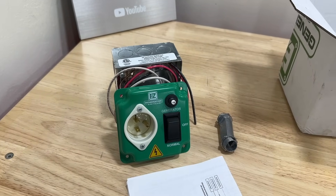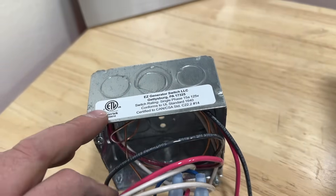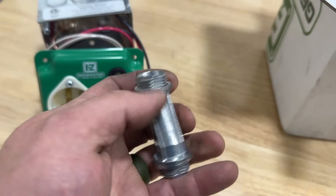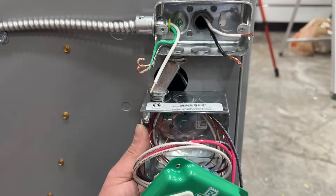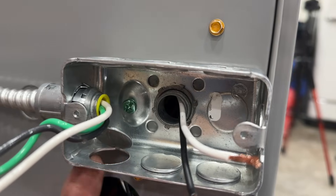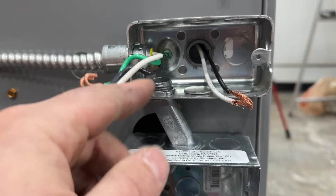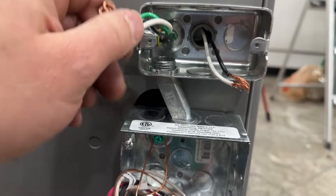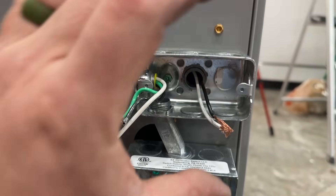This is what's going to be included in the easy generator switch box: we have the box itself, the device with the ground wire pre-attached, the installation instructions, and a mounting bracket. You can remove the original box altogether, but what I'm actually going to do is install the new box right alongside it to avoid having to remove the existing cable for our grid power. I knocked out a knockout with a flathead screwdriver, bent it back and forth, put our box in, put the nut up, and threw a couple of self-tappers just to make sure nothing moves.